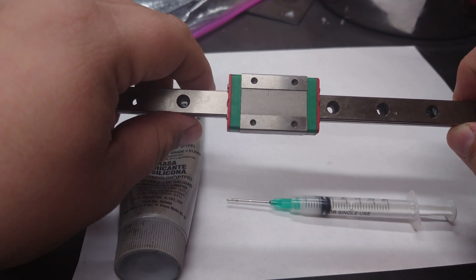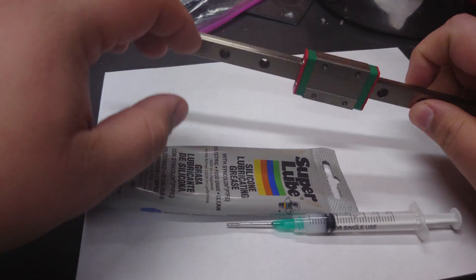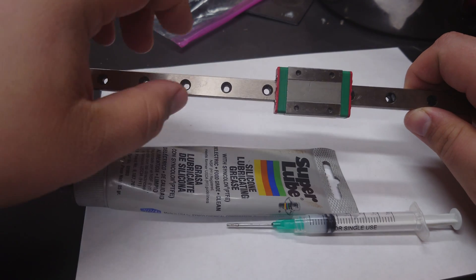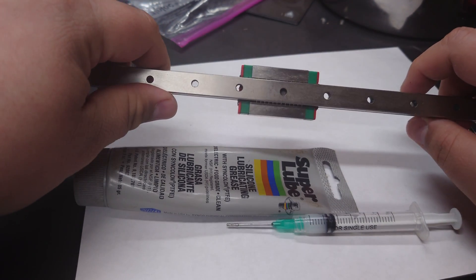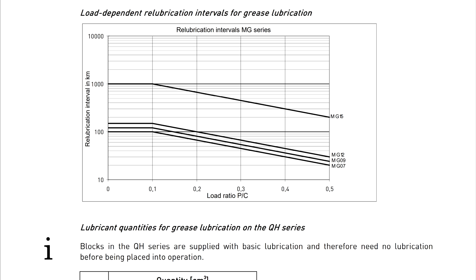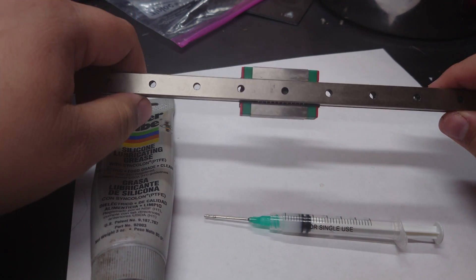So how do you go about properly lubricating those ball bearings? Let's first talk about the type of lubricant we're going to use. When it comes to genuine Hiwin rails, there are a number of different lubes you can use — everything from oil if you're in an application that doesn't have a lot of load, or grease will also work as long as you use a reasonable amount and apply it the proper way. For documentation on what type of lube to use for what load rating, as well as re-lubrication intervals, refer to the Hiwin documentation linked in the description.